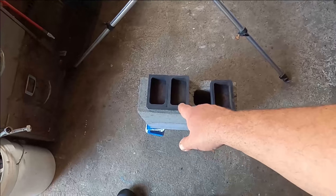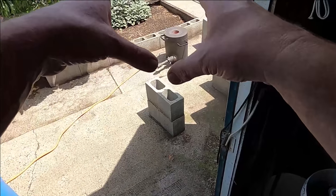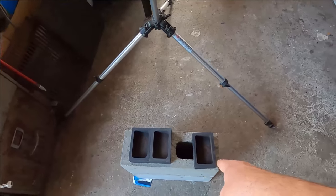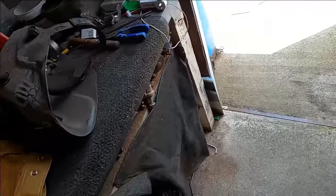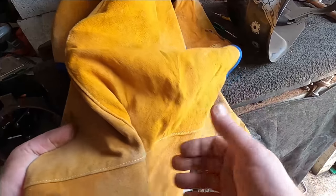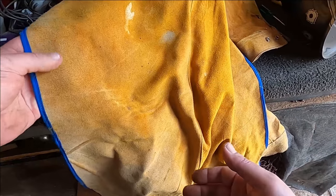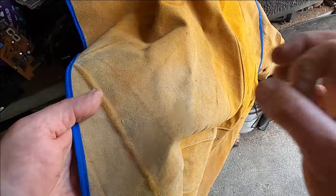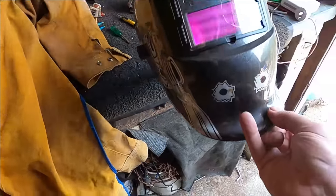And I'm using two molds that, before the copper melts, I'll put on top of the furnace to heat them up. And this one here is just a spare one, so I can empty out what's left in the crucible. I've got my vest, or it's actually a whole jacket, a cowhide jacket that I put on just in case when I pour the copper there's a little bit of splashback. If little bits of copper splashed up, this would protect me. And I also got my face mask.